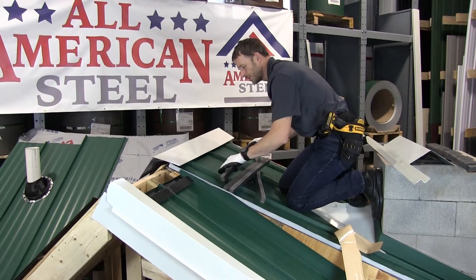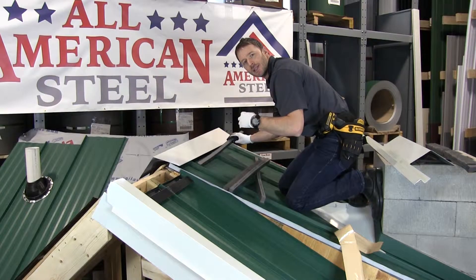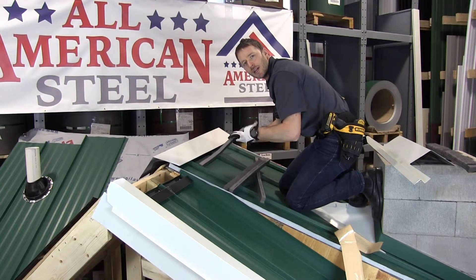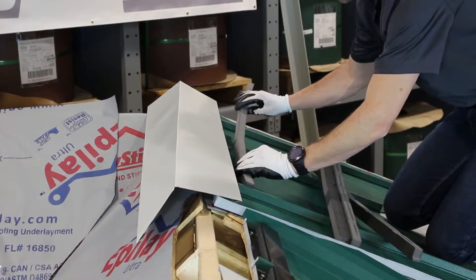I made my marks on the ribs and I'm going to set my closures back about one inch. The reason I'm doing that is when you look up at the ridge cap, you don't want to see the front of the closure — I just want to see a shadow line. The second reason is I don't want UV hitting the foam closures. The more exposure they have to the sun, the faster they dry out and crack. So I'm going to set them back about an inch.